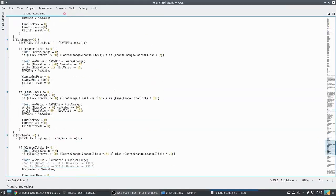I also set up timers for that multi-function thing. If you hit button one then button two, it would do both commands right away. So I set up a timer that gives you a little bit of lag — about a 15 millisecond window where you can hit two buttons and it ignores until the timer passes. Every time you hit a button, it resets the timer. So if you hit one, two, three, the timer resets each time, then it checks and goes: okay, you meant all three buttons — do this. That just took a lot of trial and error and I figured it all out.